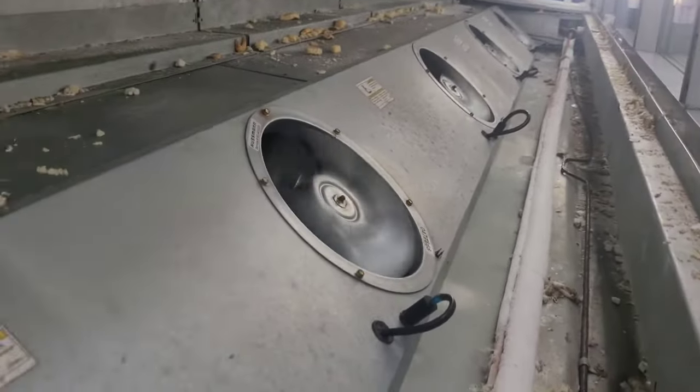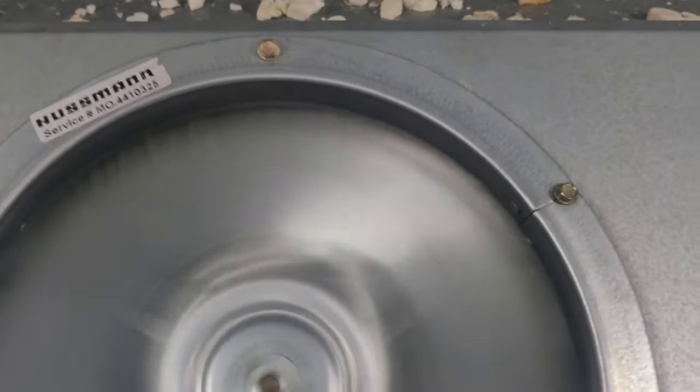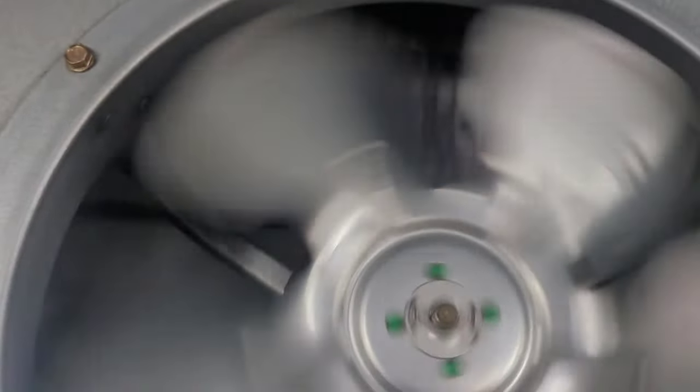So once I get the bottom covers and grills off, I'll see if it's got a nice effect there. If you come across this and you see ice in the back behind your fans, that just sucks. You automatically know that you've got to get a hose out, take the covers off, wash it, defrost it, and get all the ice out. And that takes at least an hour.